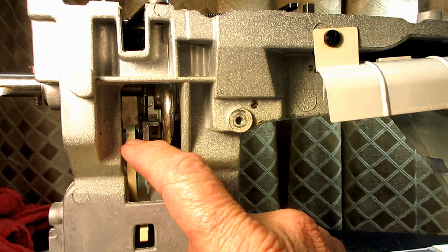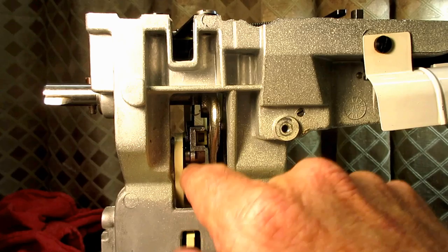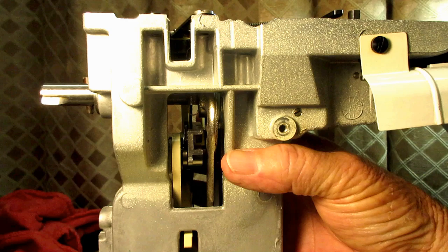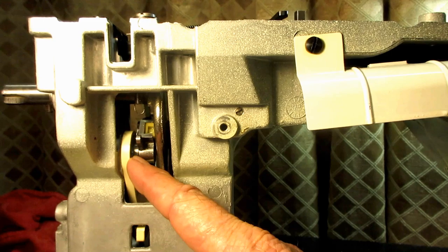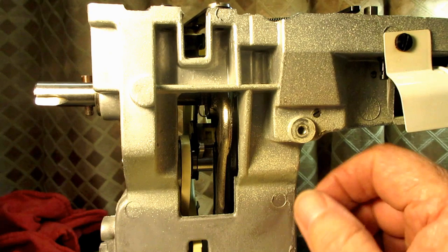A cleaning and oiling — if you took off the nose cover and the back cover and got in here and cleaned around with some alcohol and a brush, and got some fresh oil on there — that would definitely help. You want oil on the slide and right there where the screw comes through the bearing into the feed regulator. But other than cleaning it, the only other thing to reduce this pressure would be to replace this spring.